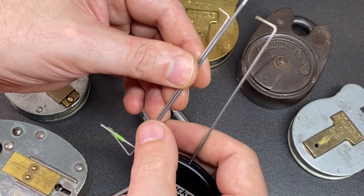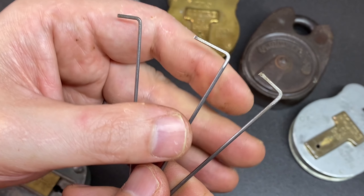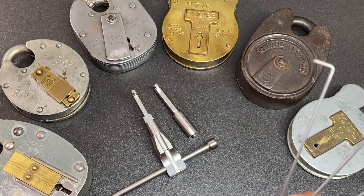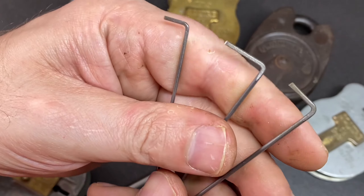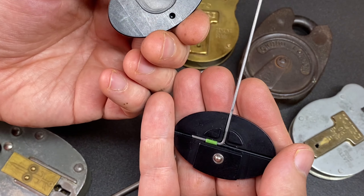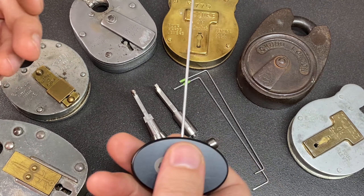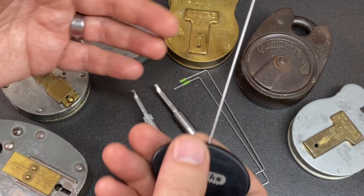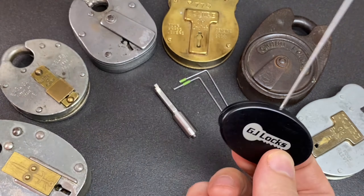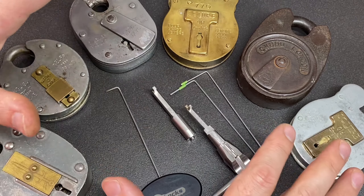The keys are made of materials — a mixture of brass and other alloys — which are stronger than filed-down blank keys. It comes with three pick wires, which is really nice. If you do any lever lock picking, making your own wires is basically where you should start anyway. The nice bit about the wires is the handle — I just love this lozenge-shaped, ovaloid, dovetailed, detented handle. It's comfortable, it works, it snaps on and off easily, and you can change your wires without any screws — the whole thing is finger-tight or slides on and off with the ball detent.